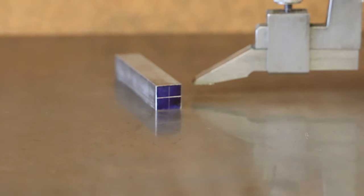And there you can see the intersection of those two lines should be pretty close to the centre of that piece of work. I could now, of course, just centre punch it and drill into that, but the act of centre punching brings in a degree of inaccuracy because it relies on me getting the centre punch exactly on the cross, the intersection of those two lines. What we'll now do is move over to the milling machine and I will clamp the workpiece onto the table of the milling machine so it is standing vertically.